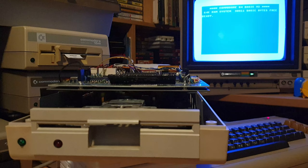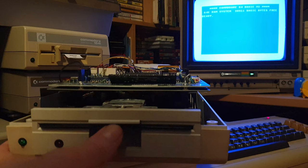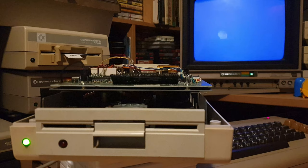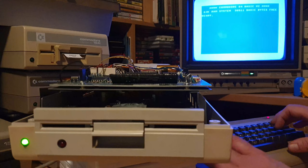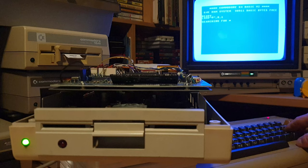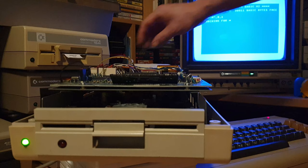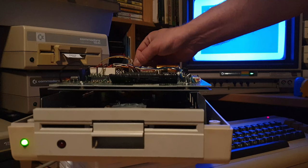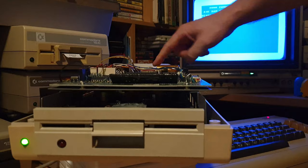So we're over at the Commodore 64. I'm going to put Tony's disc in and see if we get anything from this drive. Turn the Commodore off first, turn the drive on, then Commodore on. Attempt the load command. We're getting nothing from the drive — it doesn't list anything, although it does perform correctly. When I brought it over here, I can see that one of the serial ports on the board is loose. So we're going to take that back over to the repair bench, pull this board off, and have a look at what's going on with that.